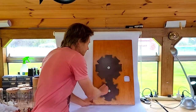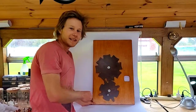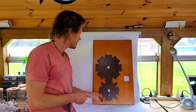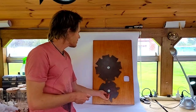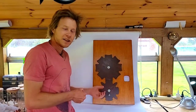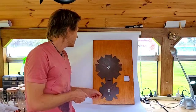It worked okay but there were a couple of problems. One was it's incredibly noisy, and that probably could be improved with perhaps more of a Geneva mechanism rather than this intermittent gear mechanism. It was also hard to get the speed up fast enough to get your animation as smooth as you'd really like. But there's still some experimenting to do here.